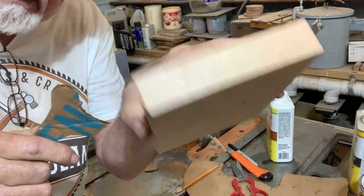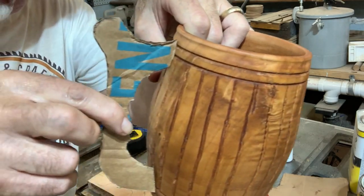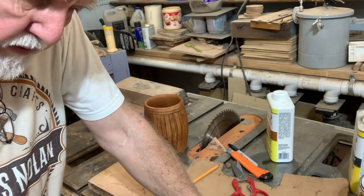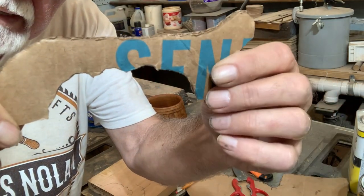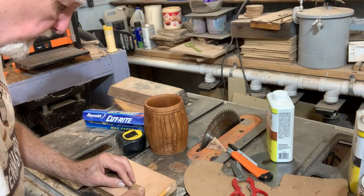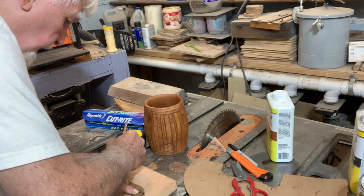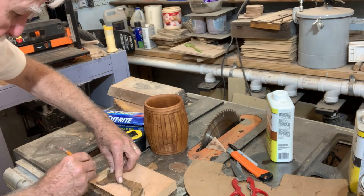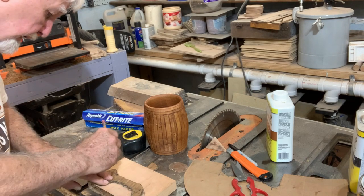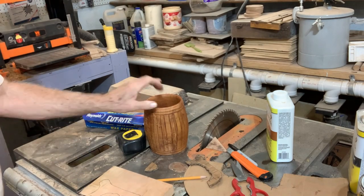Here we can see we're one inch thick, or one and a quarter, or whatever you want to make it. I took a piece of cardboard and made me a pattern that I wanted, measured out the height of your handle. You can go Google mug handles and find all kinds of patterns for different shapes, or you can make your own. I just made my own, sketched it out to try to make it as symmetrical as I could, and then traced it. Simply take the jigsaw to it and cut it out a little big on the saw and then let the sander do the rest. We can do a little routing and do whatever you want to get the corners shaped off.